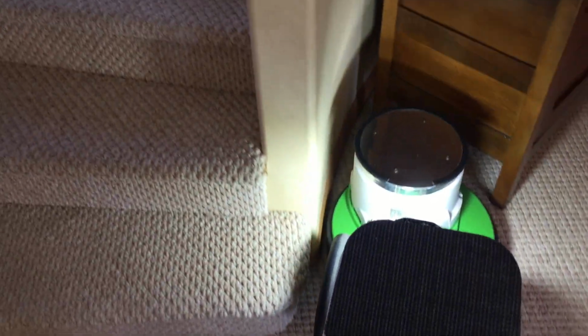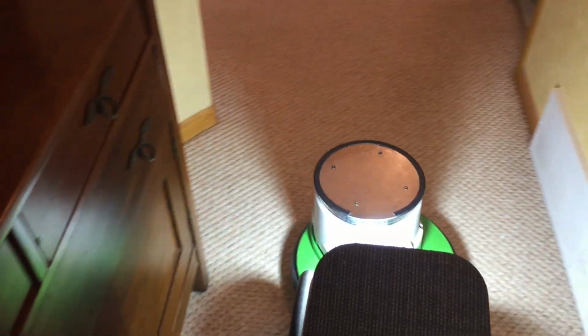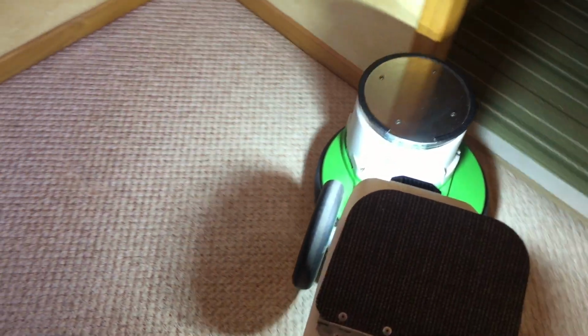This is one of those carpets that's actually difficult to steam clean, because it really benefits from the scrub of a machine like what I'm using here. With steam cleaning there's no real scrubbing action, just relying on the spray and the suck. When you steam clean it, the moisture gets underneath the loop and takes a lot longer to dry. That's one of the contributing factors to the wicking effect, and why berbers can be a challenge to steam clean.